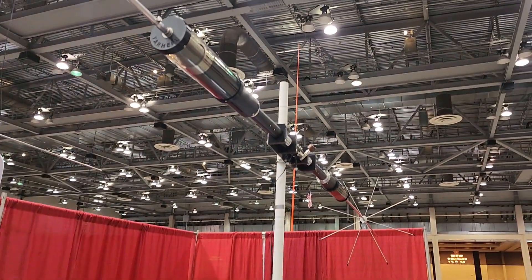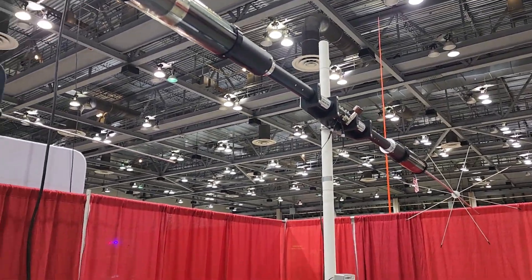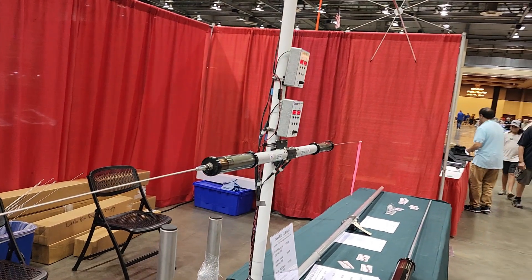I just happened to catch this display you've got here — is this truly a dipole? This is a dipole, the Model 1000. It's got large 3.5-inch coils in it. It's not very popular because it's expensive; the smaller one is most popular. We've got it set up here on display with capacitive hats. You can do any kind of combination on the end — a single whip does 10 through 80 meters; with the hats it's 17 through 80. You can put longer elements on and you'll lose some upper bands but get more performance on the lower bands, depending on the coverage you want.